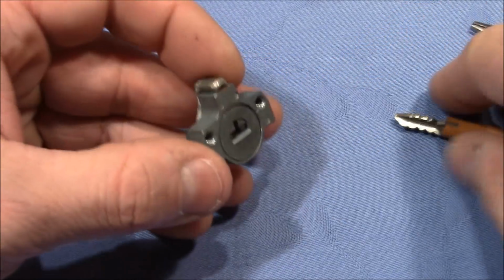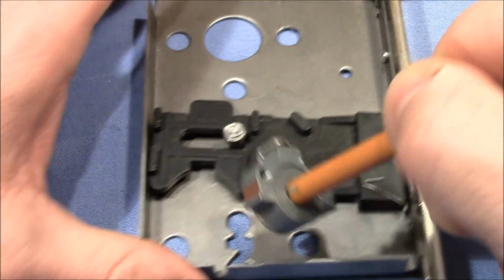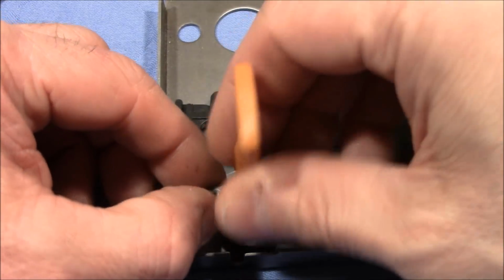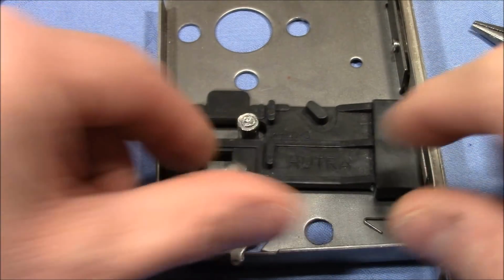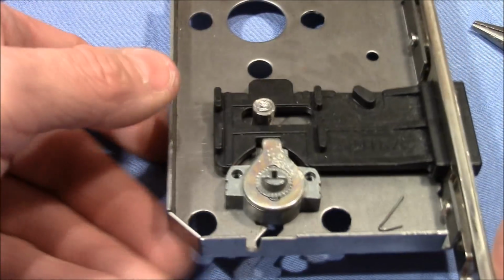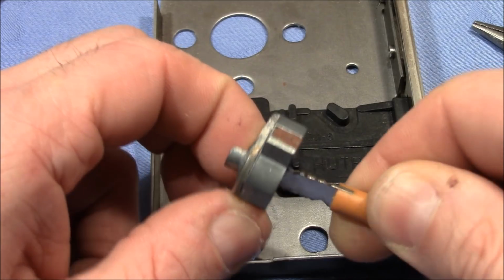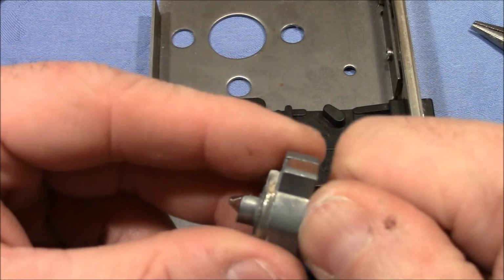So I'm going to see if I can operate it. Yes, I can. So how does this look inside the lock? You have to drill holes and put it inside here. Maybe the other way around. Maybe like so. Let's see. Maybe like this. And then if you operate it from the other side, you can imagine how the nose then can move the bolt left and right.